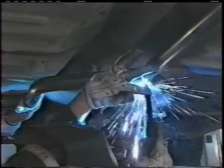We're going to wire weld around that gap, going in that circular motion again and following from top to bottom. And we'll actually fill that. We didn't have much of a gap around there, you understand, because we fit that so well before. And that saves a lot of time for you.